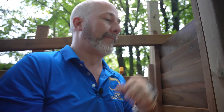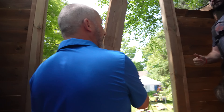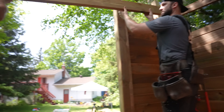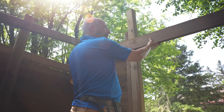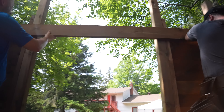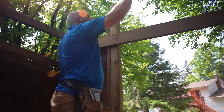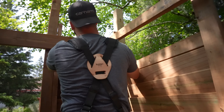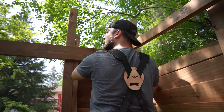Beautiful — this is just a structural header. It should be flush with your two by two outside corner. Your two by four should be making contact with the siding on the front — there's like an eighth of an inch gap. A split hair — I'm not worried about that. I'm actually a little bit high over here. How are we for level? Throw your torpedo in there. Yeah, that's perfect.